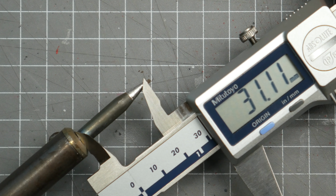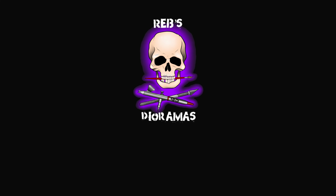It does have a couple of semi-serious issues that you need to be aware of. Because it's USB, the tip has no real isolation from the power supply. That means this isn't ESD safe, so if you run it from a USB mains plug, it could be passing current through the tip and into the components you're soldering. This is because most of the mains to USB plugs have some kind of floating voltage because they aren't earthed. This could cause damage, especially on sensitive things like some LEDs, photodiodes and ICs. This is the reason I run it off an 18V battery. That way it's more isolated and doesn't really pass current.